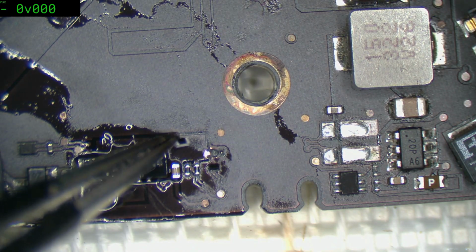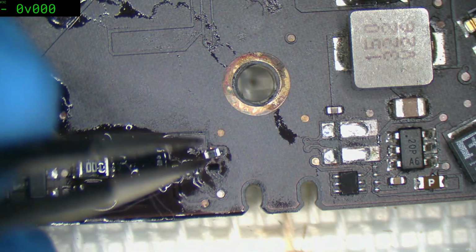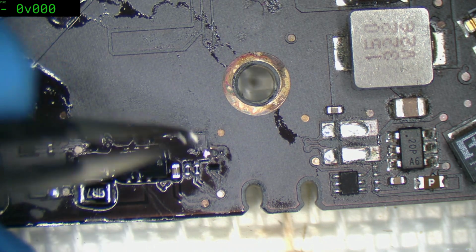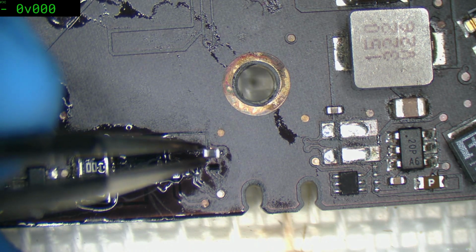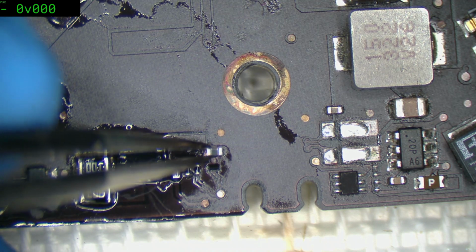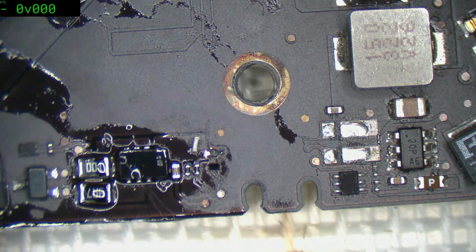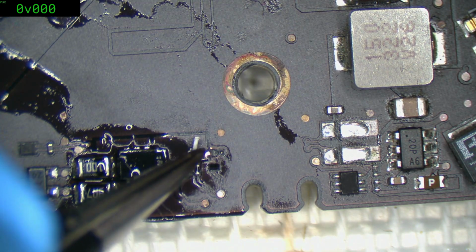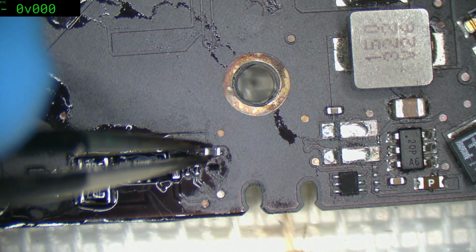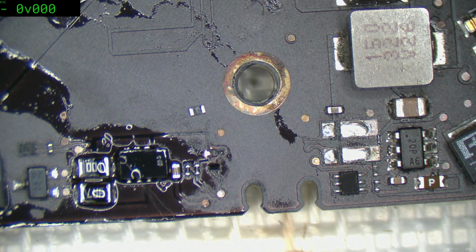You see it's quite large compared to a 0201. If it's too large, we'll just go 0201 and then put a small jumper on it. I'm kind of curious to see if we can do it this way. There may be concerns about it shorting out, which may be legitimate. Yeah, maybe they will. It's a choice here really. I can cut back some of this ground, or I can... choices. Let's try with the 0402 to start with.